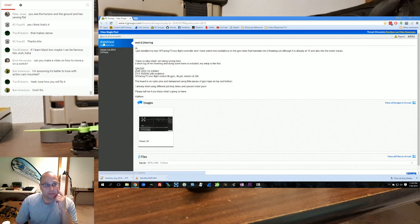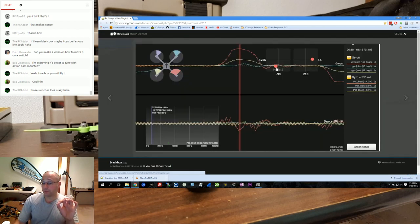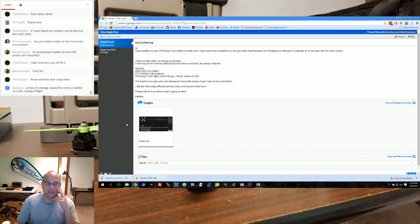Yeah, so Daishi, let me close up here. I haven't even really looked at your log, but what you're seeing here is probably aliasing from your sampling rate or some kind of low magnitude resonance or harmonic or something. It's almost always when you're at low throttle, in my experience, and as soon as you throttle up, the RPMs go up, all of that low frequency or mid-frequency noise moves away and it goes away. So I wouldn't worry about it at all. It's not affecting anything. Don't worry about it.